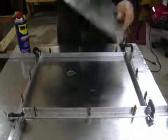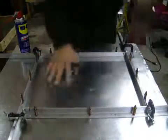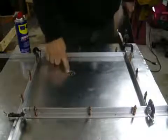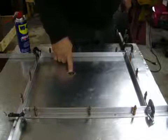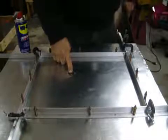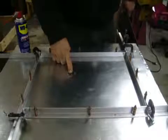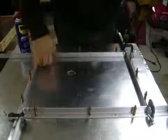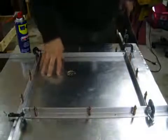So what I've got here is a piece of 40 thousandths aluminum and I've drilled two starter holes. What I've got here is a little router table I made just for this purpose using a standard off-the-shelf Ryobi router from Home Depot. In it I've got a one-eighth inch single flute bit. I use these guides to guide the work piece around the bit as I make the opening.